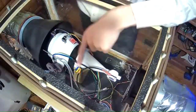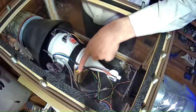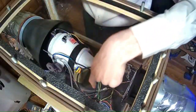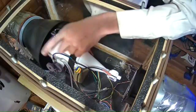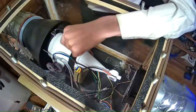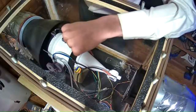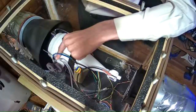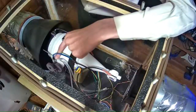Also, I have my brushless motor inside this module. These are the 3 prongs for it. I have a pitot tube that goes down to a differential pressure sensor, and I have a gearbox. Some people may be asking why I have a gearbox for my Hall effect sensor. Well, the answer is that my brushless motor spins at 50,000 RPM. The fact that it spins at 50,000 RPM means that my Hall effect sensor cannot measure the RPM. It can measure up to about 6,000.